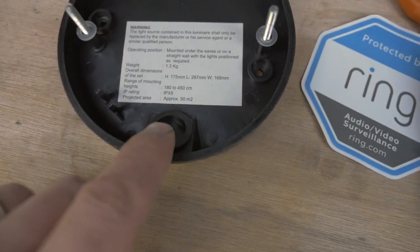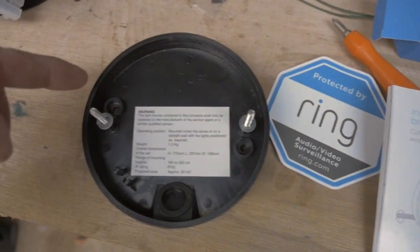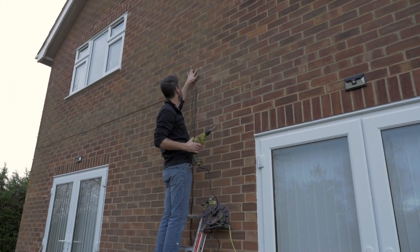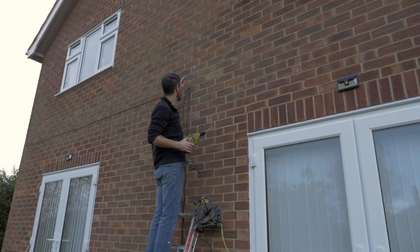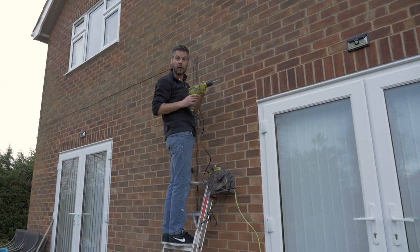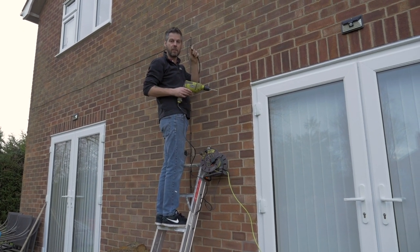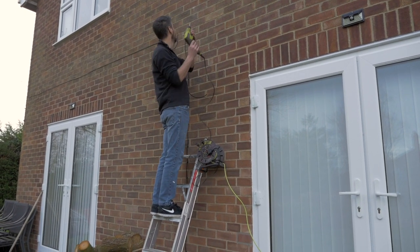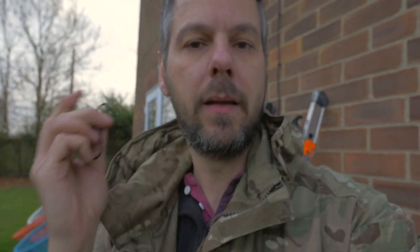So I've run the wire through the wall. We've just put in the brackets and run the cable. We're going to mount the brackets, put the cable through the bracket, and then secure it to the wall. Then we'll do the cabling — presenting the wires from here to the back of the unit. Then we'll screw it all together, plug it in and go from there. We've got the cable through and put the bracket on the wall. We strip the cable giving earth, live, and neutral. They give you a handy little hook to hook the main unit onto the wall while you connect it all up. Then you push it together, do the two screws up, and we're done outside.